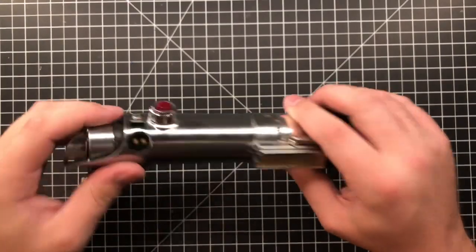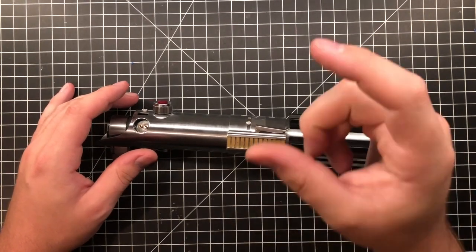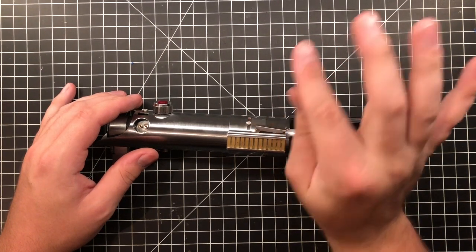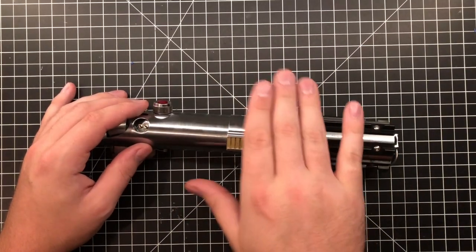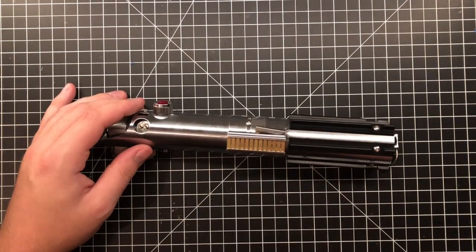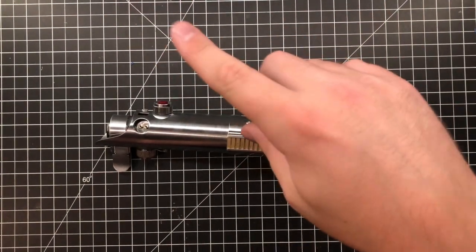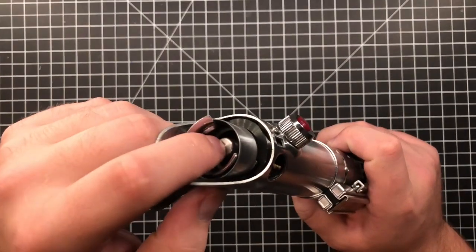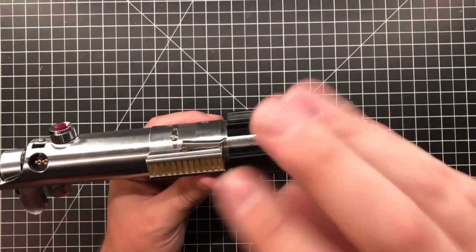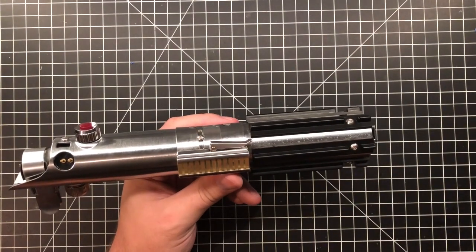the blue main LED. And so what I did, if you go through your configuration file, you're going to see for your main colors in your override file that every single flash color has the blue set to literally just 1, because this is wired as blue, green, white. You'll see the blue in the program file with a 1, and that just says that this LED is going to be on during your flash, but very, very dim. So you're really not going to even notice it, but that allows the crystal to also mimic that when it's flashing during the lock up and the clash. Just so you guys know.